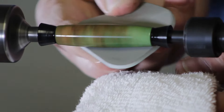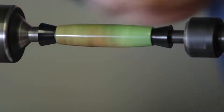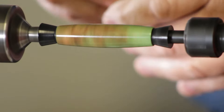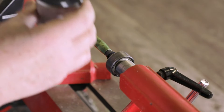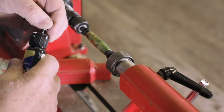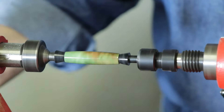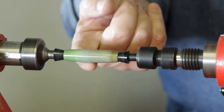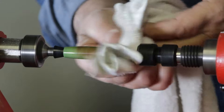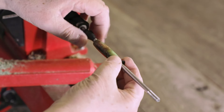So how long has this taken us? About a minute and a half — that's how quick and easy this is. When I'm finished with this, I'm going to take a little bit of one-step polish. Shake this up real good. This stuff is really nice — it gets rid of the little swirl marks that you can't really see with your naked eye, and it does a nice job setting it up for when we go to buff this. I'm going to take a tiny little bit on my finger, turn the lathe speed back on to about 2000 RPM, put this on, and then with a dry spot of the towel I'm just going to whip through this. And this thing is really shining.